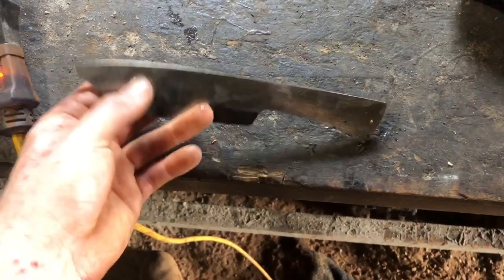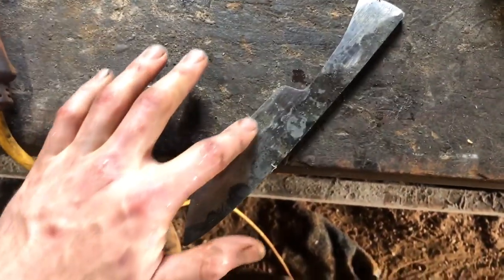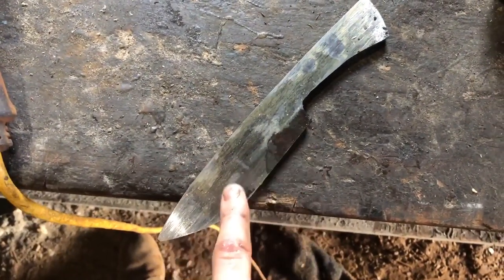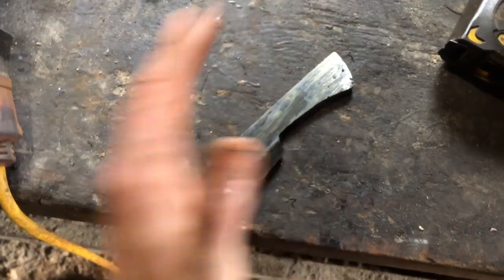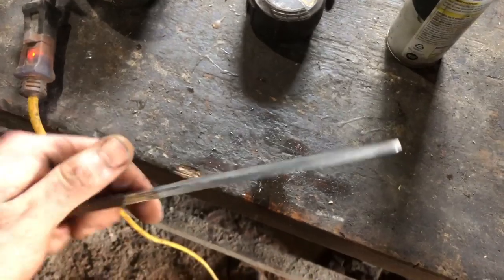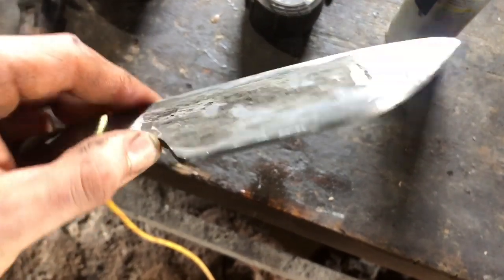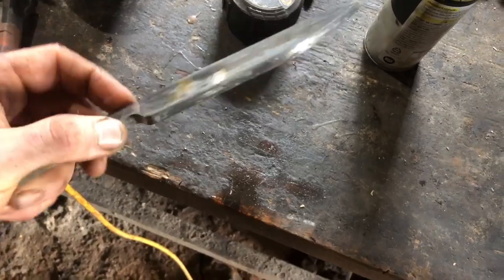I wanted to show what I'm doing to correct the core offset — I've grabbed the flat on the side where the wrought iron was thick and I want the majority of material removal to come from that side, while barely kissing the other side just enough to flatten it. It's essentially shifting the central axis of the knife by selectively removing material. After grinding, the spine is down to about 3/16 of an inch — where I want it. The edge is still a little thicker but that'll come out when we do the bevels. It's a lot better than it was.